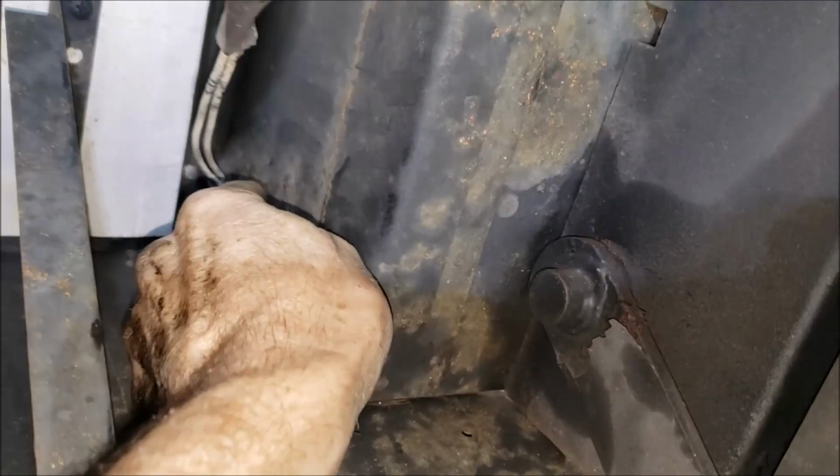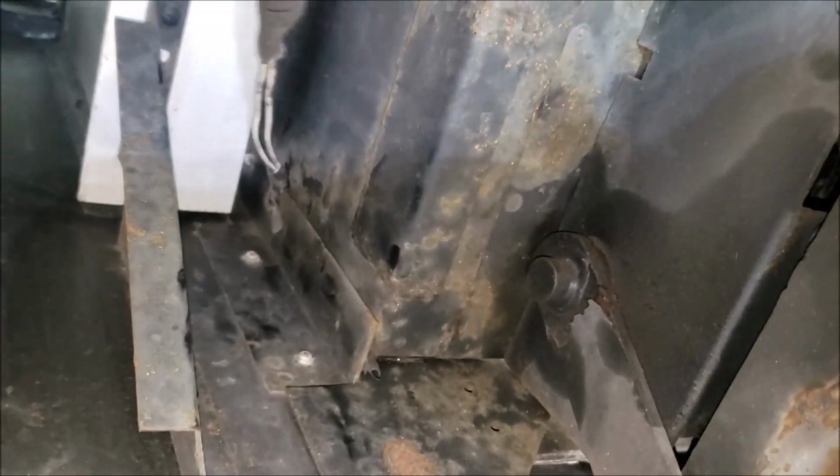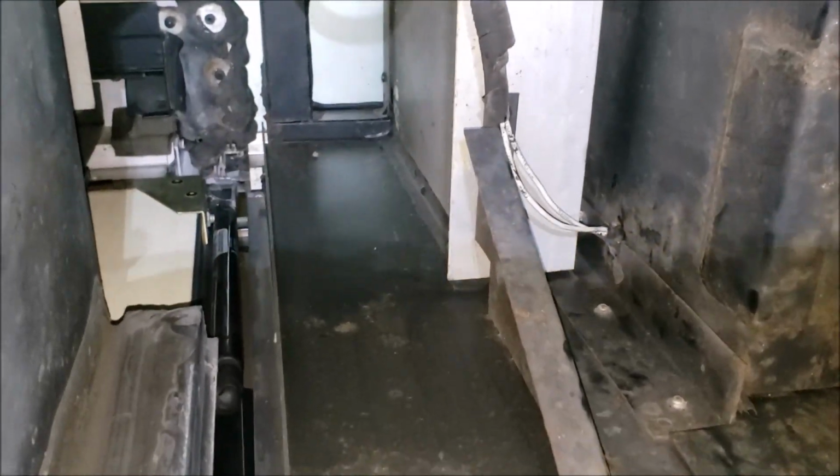I noticed this wire. So those wires hanging down low and tugging and pulling. Well, this is the wire to my little magnet switch for the doorstep. And see those wires, that goes right through a little metal hole. There's no grommet or anything there. So the constant tugging and pulling on that wire could cause a short. So I'm going to just put it up here like this, zip tie it, get the weight off of it. So it's little things like that that you find that you can fix yourself and save you grief down the road. Now don't that look better? It's all zip tied up. No longer got the weight tugging on it. It's those little things that matter and that add up to a successful vacation, so you don't have troubles on the road.